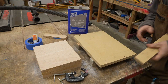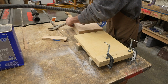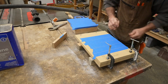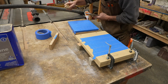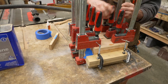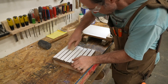When I started this project I was still using the blue tape and CA glue hold-down method. I used a separate small piece of MDF as a bottom alignment board because tape tends to pull a little MDF off and I don't want to wreck my main table. This also lets me set everything up independently, place it on the table, and machine another box at a different workstation simultaneously. I found I really had to clamp them together while the glue dried — it just didn't dry fast enough and using an accelerator was hit or miss. Since then I've switched to double-sided tape with clamping, which works much better.